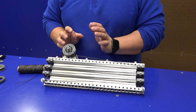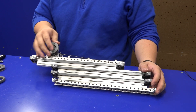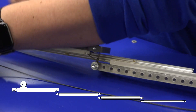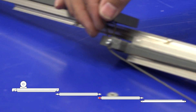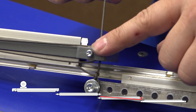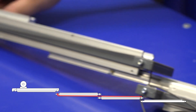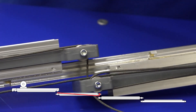For the down cable, make sure the system is fully extended — either twist the pulley by hand or run it with your robot. Start on the second-to-last moving part: the cable goes through the outer pulley holder, follows along the same path, and goes through the outer pulley holder on the next stage. Continue all the way down to the next moving stage, pass the string through that outer pulley holder, and bring it back to the other pulley in the same pulley holder.